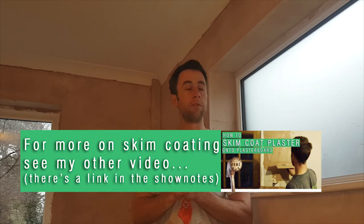In all cases I've put the bonding coat on first — and plasterboard — and on top of that I'll do the skim coat. Teaching skim coating is a whole different topic, but I've already covered it in a separate video. There is one difference when skim coating on top of old plaster or bonding coat: put some PVA on first, let it dry overnight, and then just before you skim coat, PVA on again — let it go tacky, sort of half dry, half wet — then skim coat as normal.